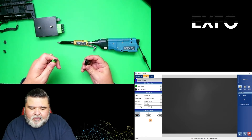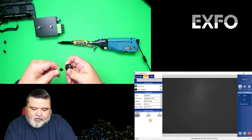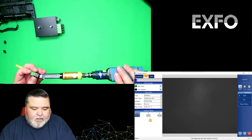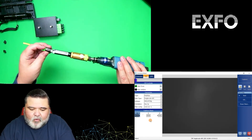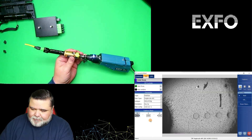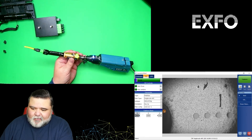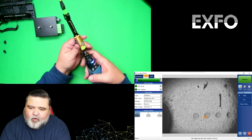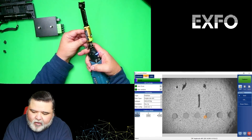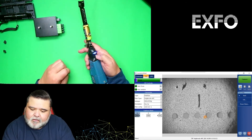Normally I'll take the fiber side, pull back a little on the boot, and push down — this allows us to insert the fiber and you'll hear a little click when it's secure. Then I'll plug the FIP side in as well. The key orientation is important, and you'll start to see things happening on screen. Right now it's doing the auto-focus, auto-zoom, trying to center the image. You can see the little pin there — this is the pin on the actual MPO itself — and then you can start seeing some of the fibers. I orient myself, hold the trigger, and slightly pull down, reinforcing it with my hands.